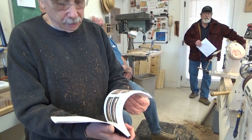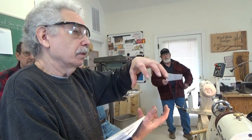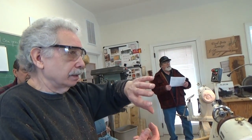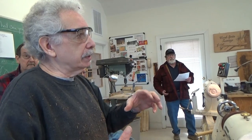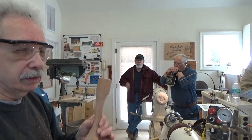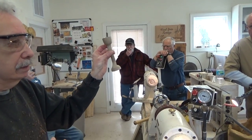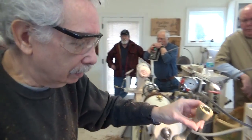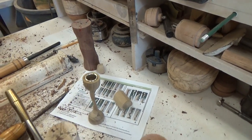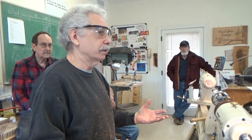The squatter the wood, the more, quote, artsy it gets. And you tend to get stacked clamshells, bent over clamshells. With thinner wood, you get better outcomes where you can get more functional pieces such as this and the other type of candlestick like that. Once you start thinking about the number of axes, the placement of axes, whether you want arc type, circle type, twisted axes, or parallel axes, you start getting into an almost infinite number of shapes.